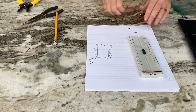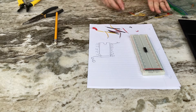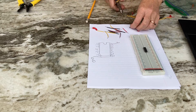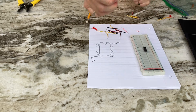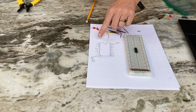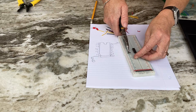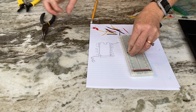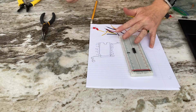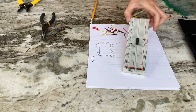When making any circuit, I make a bunch of small jumpers and also tiny jumpers I call little staples. They're very hard to make because they're tiny, but I like them that way. I have to connect pin seven to ground and pin fourteen to power, but I want those connections placed away from the main circuit area.